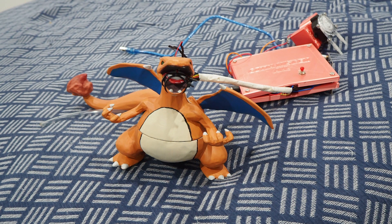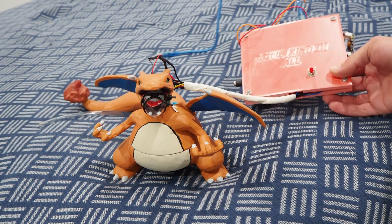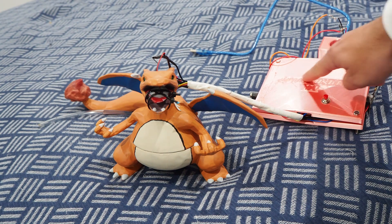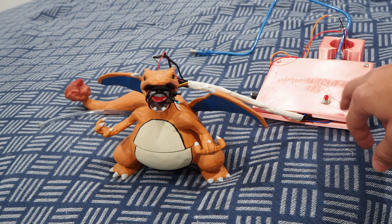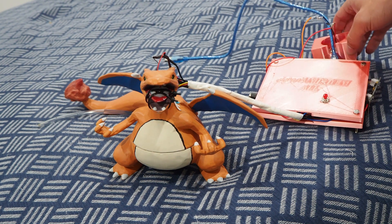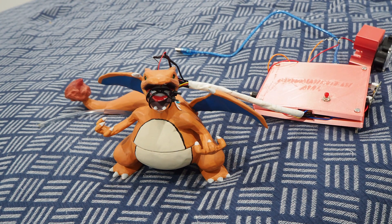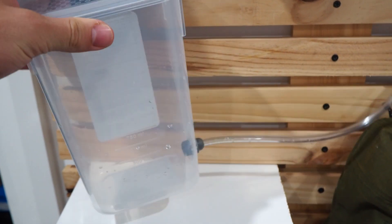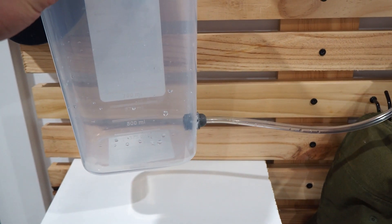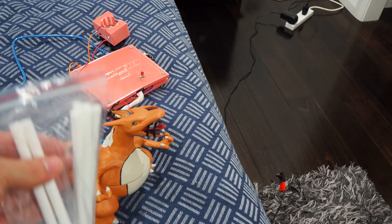Now it's time to finally put the project together and see the final Charizard model. I printed a junction box to hold all the wires and components in one place, with a fine print saying 'Gotta Mist Them All' — the name of the project — and a button on top that allows us to control the diffuser locally. Next we have our pump, which will be mounted externally to the other electronics. Over here we have our water tank that will sit adjacent to the other components. Its capacity is about 15 times that of the actual diffuser, giving a refill time from 30 minutes all the way up to a working day when considering the effective humidification rate. I've also got some cotton wicks — their role is to absorb moisture and take it to the bottom of the atomizer piece to ensure there's always water available to the module. I'm going to go ahead and insert this into the base of the Charizard.